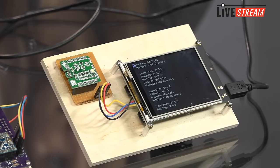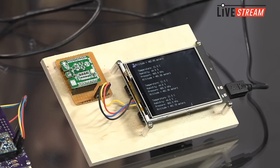And it's talking to a weather click. Adafruit has a BME 280, and I give full credit because all the BME 280 support I'm using comes from the Adafruit libraries. If you have a sensor board, and I'm flat out saying this for both SparkFun and Adafruit, these are the two places that you need to go look for Arduino libraries, or now CircuitPython libraries for Adafruit. It's just scrolling some BME 280 raw data on the screen right now, but I'm not a Python programmer, but I'm learning, in all fairness to Lamore. Fighting 30 years of C programming paradigm, I was able to get that BME 280 up in a few minutes, which is very impressive.